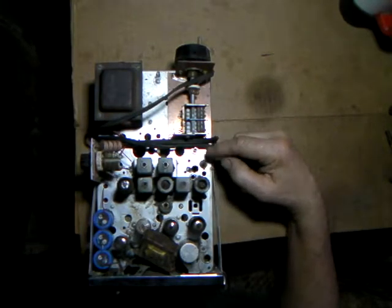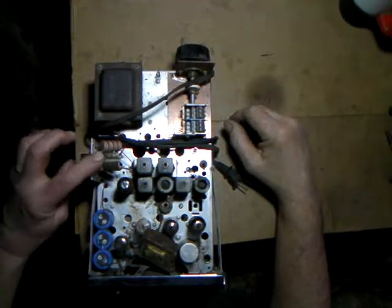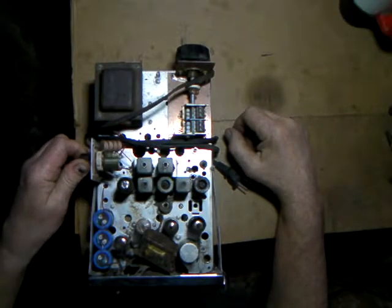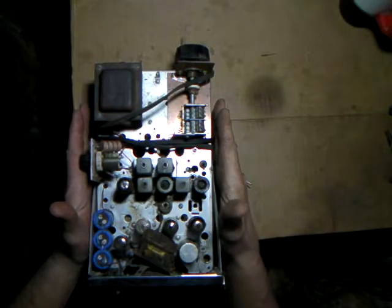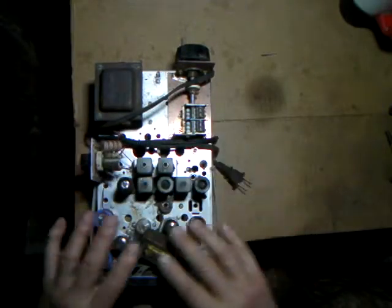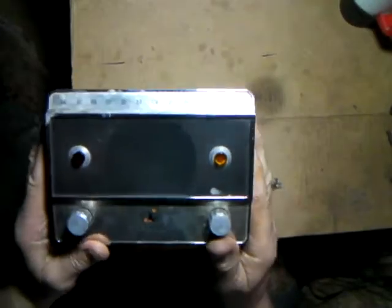By switching a tap on the coil it can go into the 160 meter band. I've also made a BFO so I can bring in the CW note. So I know this concept works - it's really slick and easy. We'll make a better-looking chassis using the parts. This is the 202 - the schematics are pretty much the same layout.